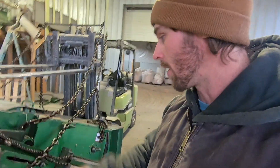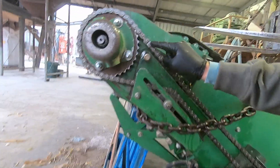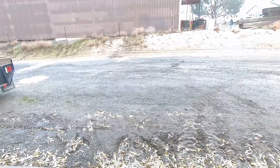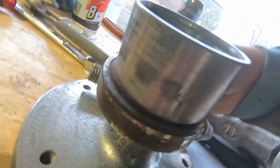The feeder house chain is now properly installed — I had to add a half link, but that's all ready to go. The old chain is useless junk. The stub shaft, old bearing, inner and outer races — all junk. Let's go ahead and throw it all away.